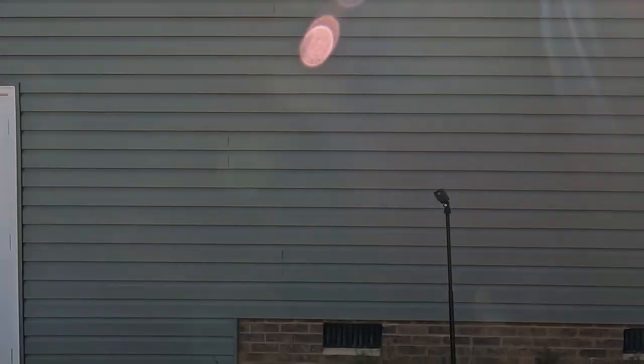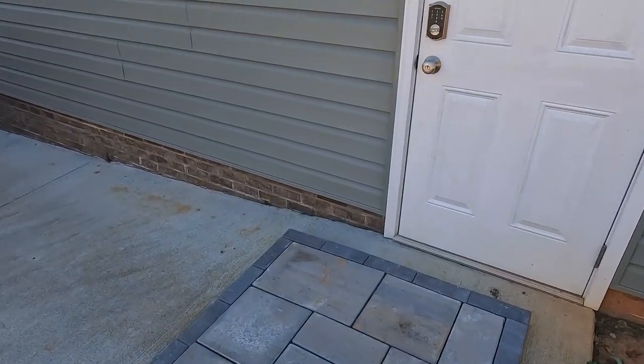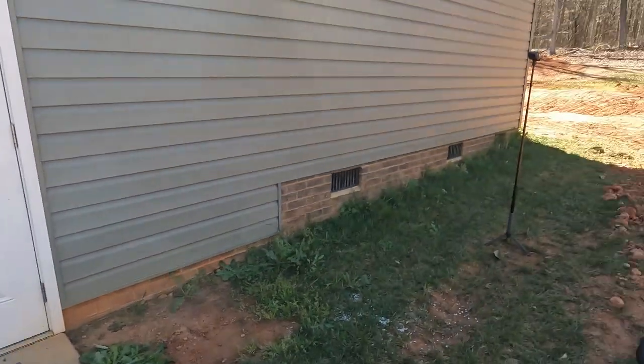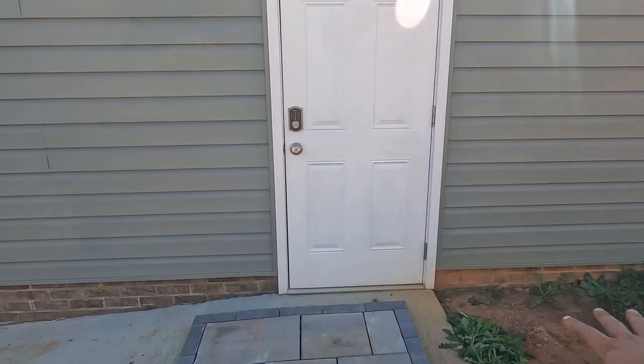But the first thing you need to figure out, whatever you're going to try to do with your pavers, is how big you want to do it. In this circumstance, you're trying to do a trash can pad. So yeah, you could measure the can, see how big you want. Better thing to do, go ahead and lay some pavers out. Make sure it's a good size, and then start building to that, because I've laid these pavers out where I have hardly any cuts.